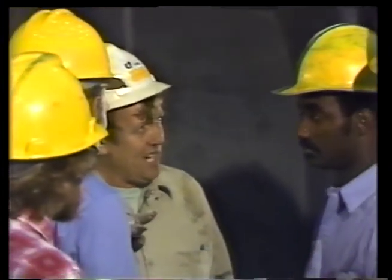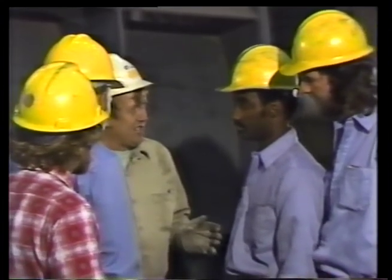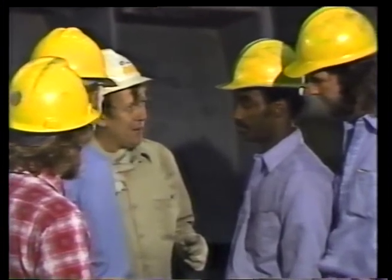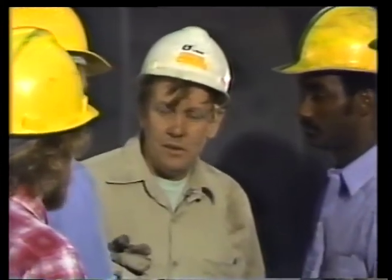Okay guys, we got to lower fuel oil booster pump from here on elevation 43 down on 29. We'll be over there by the high pressure heater. So it's going to be pretty close when we set it down on that foundation. So you guys are going to have to signal me from down there. And then I'll in turn signal the crane operator. John?